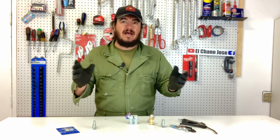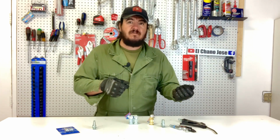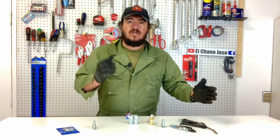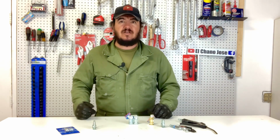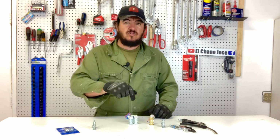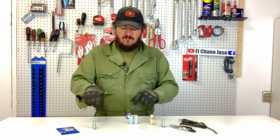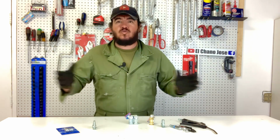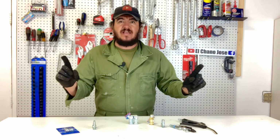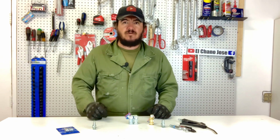That's why it can be a headache, because sometimes you have a hose, but you cannot plug it into a fitting because one is industrial and the other is automotive. The one you have is automotive and the other one is industrial. So that's why we're going to expose this, so you don't run into these small headaches. They're pretty cheap fittings, and that way you buy the right fittings for your shop, and all the tools use just one fitting, in this case automotive, which is the most common. And with that, let's show you what we're talking about.